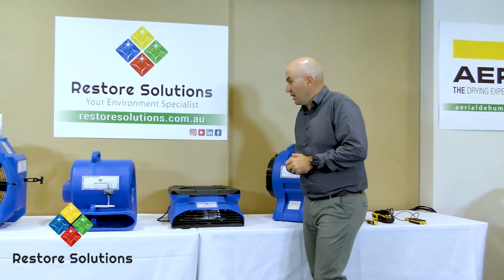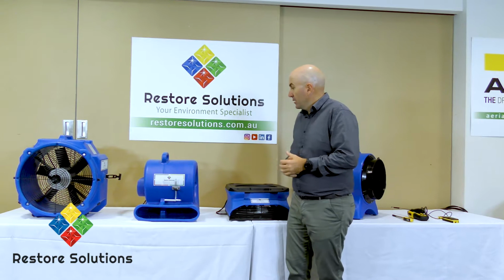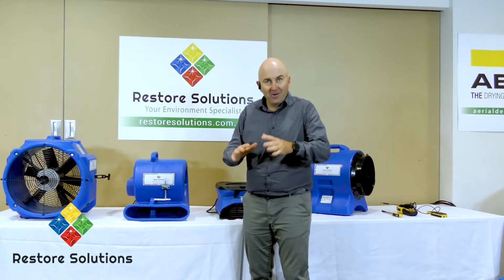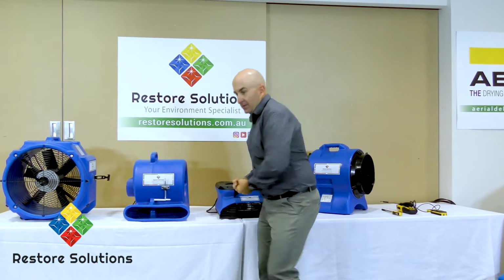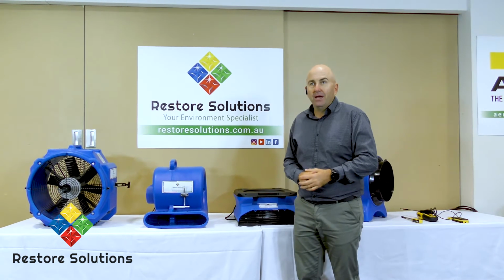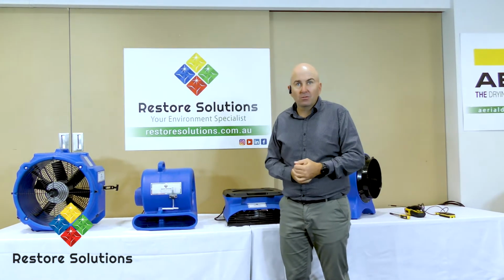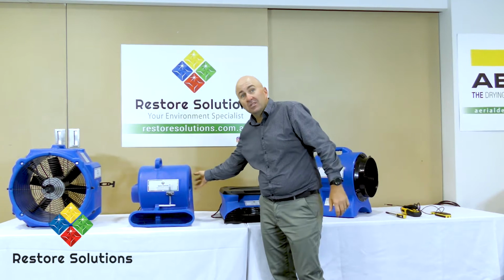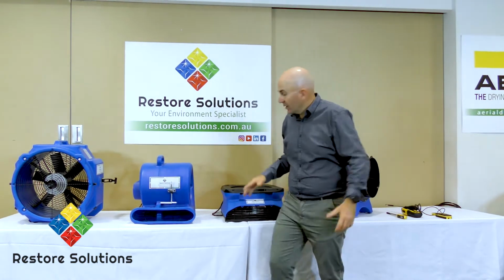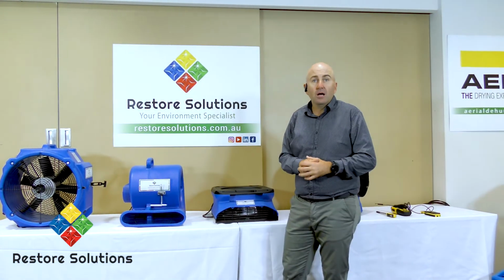Okay, so obviously we've got a warranty of 12 months with all of our machines. They're air movers. We find guys have nice jobs in their vans, and I see that sort of thing as well. So at the end of the day, if you look after fans and you put them in your vehicles, they're going to last the length of time. I had fans in my business that were 20 years old, but you've got to clean them out. A lot of the guys don't clean them out. You take the grills off, you put an air compressor in there, you clean all the fluff and gunk out. You can take the front grill off and wipe it out. At the end of the day, look after the gear.